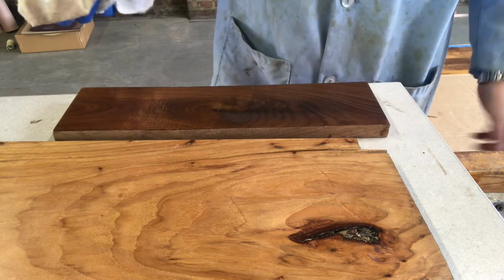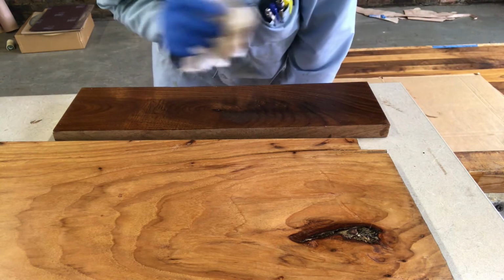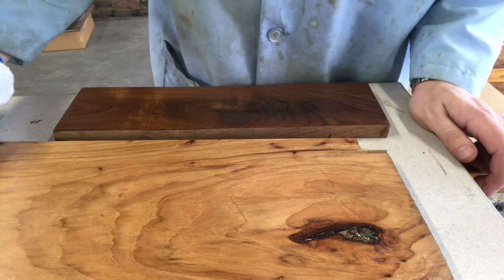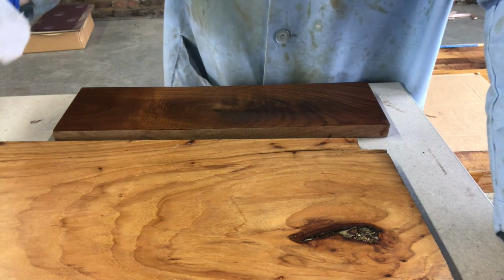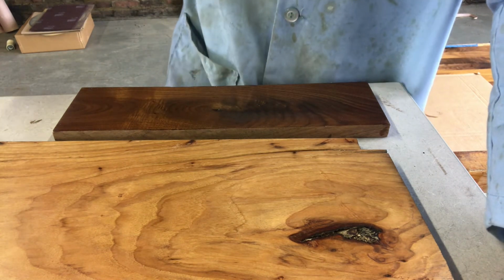We're just going to get everything coated, look for that color change, get down low and make sure you got everything a little bit shiny. It's probably going to look streaky, probably going to look uneven. That's totally fine. Again, we're going to let the tung oil do its job. We're going to let it soak in, and we're going to come back in about 5 minutes, and we're going to wipe off the excess, and then we'll let it sit overnight, and we're ready to go.